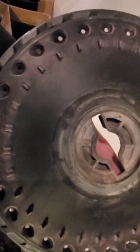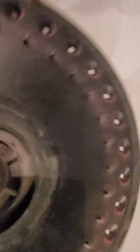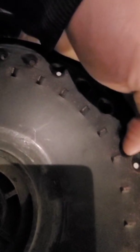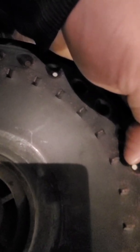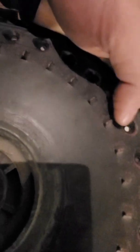As to why John Deere went to the Pro Max 40 — this right here in my hand is an original 30-cell John Deere corn plate. This corn plate has an angle cut to it where the rounded holes are for the seed to sit in. It's 30 cells around, and why this didn't work is that the vacuum had a very small margin to pull against. There just isn't enough edge surface, so the seed had to be really sized accordingly, otherwise the vacuum would pull doubles or it would drop off resulting in skips. This was an unpopular design.